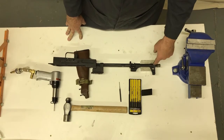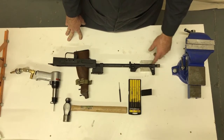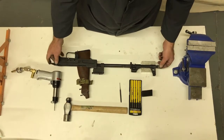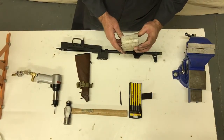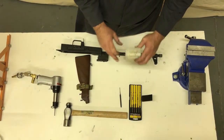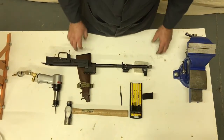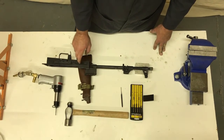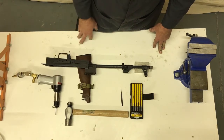These are three millimeter pins that are press fit in here, so they're a really tight fit. You're going to need to carefully bang them out. To do that, you will need a hockey puck — or I used a chunk of Delrin machined out so it fits a barrel nicely. They also make purpose-built blocks for that on Brownells. You'll also need a block over here to support it. I don't care what this stock looks like so I'm using it, but you might want to pad it if you care about your stock.